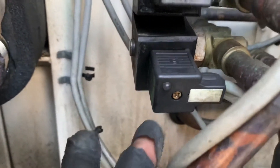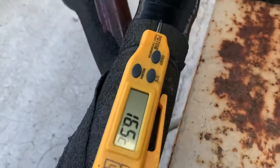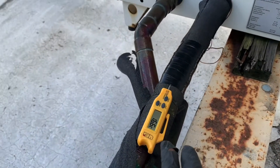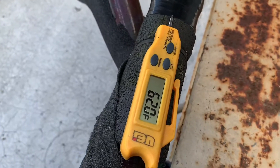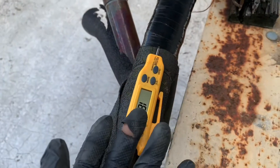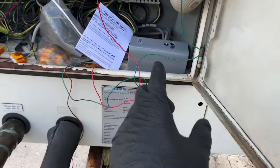It's off right now because it's satisfied. The kids — you can see we're at 16 degrees C on the chilled water or fluid return, which is 62 degrees Fahrenheit. At around 17 or 19°C the temperature controller will turn on.